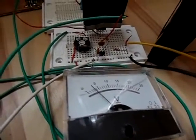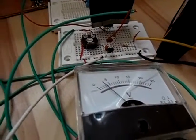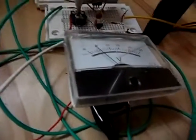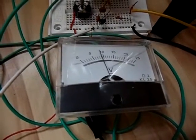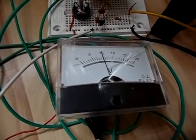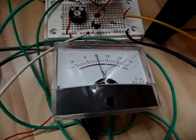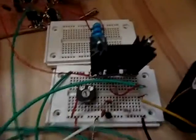I could go up to 12 volts but I won't do that, and I will tell you soon why. I will only go up to 10 volts and then I will recalculate the power. You can align the power to any level you wish in this range. Now I'm on around about 10 volts, and as you can see the voltage is rising a little bit because this transistor is heating up, so you need to cool it.